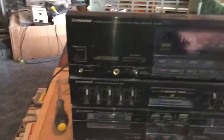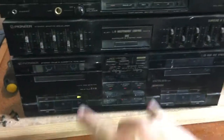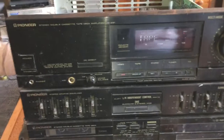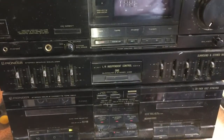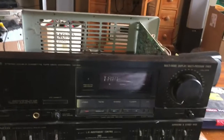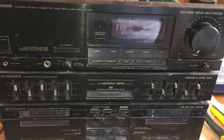All needs a good clean up — I'll give all the contacts a clean up. I'll set up the tape deck; the belts appear to be okay so I'm not going to deal with those, just the belts in the record player. At the moment I think we've solved it. I'll just let it go probably another half hour and it's purely on the left-hand channel, so if it's going to pop again it will. Hopefully we might be okay.